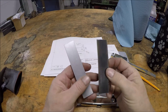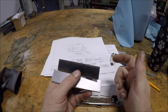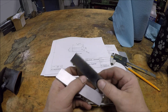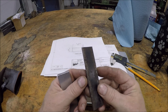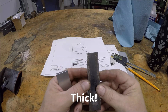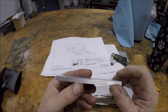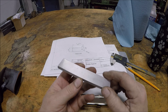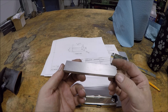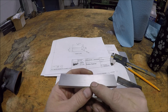I've got the stock pulled and cut to pretty close to dimension — maybe about 100 thousandths large or so, to give me enough for cleanup. Just a piece of flat bar hot rolled, eighth inch thick, a little over four inches right now. And I've got a piece of flat bar aluminum, 6061, three-sixteenths inch thick, one inch wide, about a little over four and a half inches.